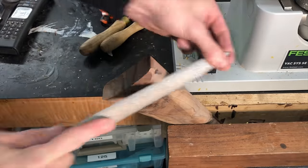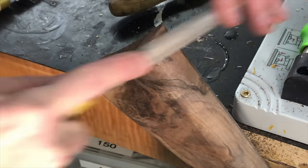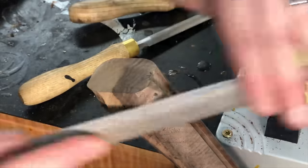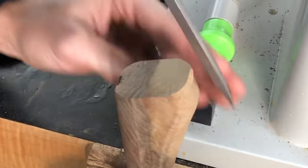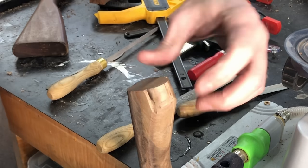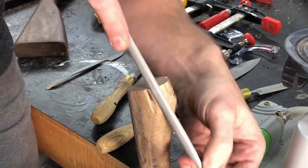Since I actually did this restoration a couple of years ago, as I'm doing the voiceover here, I'm watching the video and wondering why I didn't bring that router radius all the way to the end. I think I remember now — my high school shop teacher told us we could never go all the way through the end of a piece of wood with the router, saying that we risk blowing out the grain. That can happen, but I've learned some ways now to mitigate and really eliminate that risk. But this was Mr. Valiotis' West Albany High School shop lessons really sticking with me. And the rasp was useful for fitting it to the metal section — this just took a lot of trial and error, and this is not something I'm particularly skilled at, but in the end I think it was probably good enough for a factory Daisy BB gun job anyway.